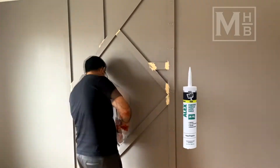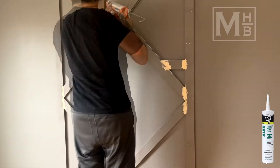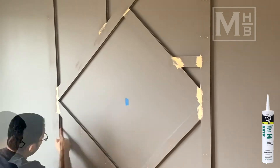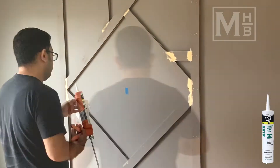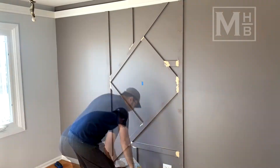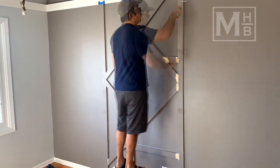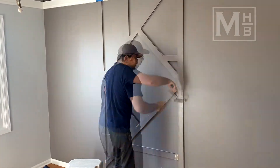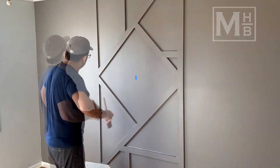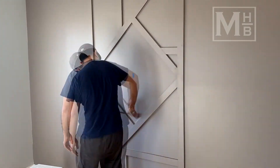As I mentioned earlier, I did not use any glue to adhere the trim to the wall. This, combined with the fact that the wall is slightly warped, meant that there were gaps in certain areas between the trim and the wall. This was not a big deal and was easily taken care of by using some caulk. I learned from my mistake in part two of the series and got myself a paintable caulk this time. I put a small bead of this on all seams and it provided a clean and professional look to the trim. I followed this up by touching up the caulk and all the areas with paint once again.